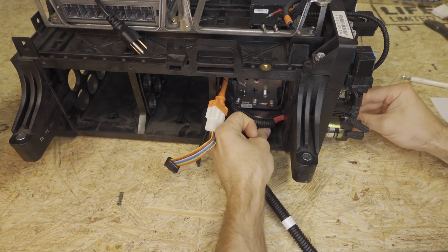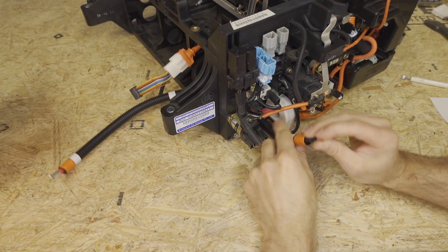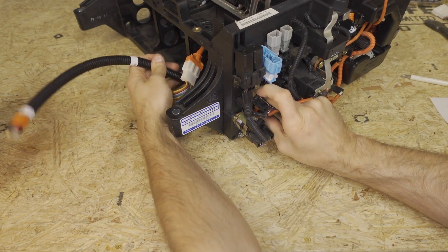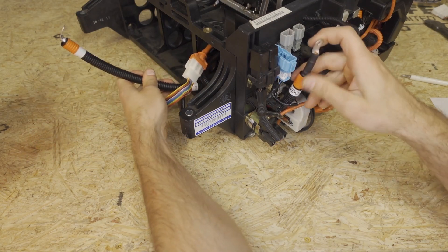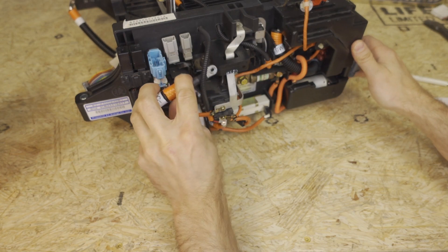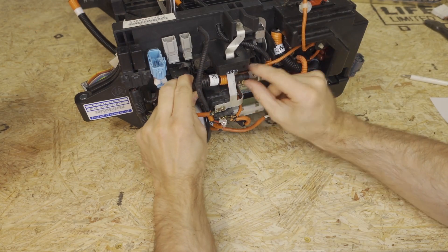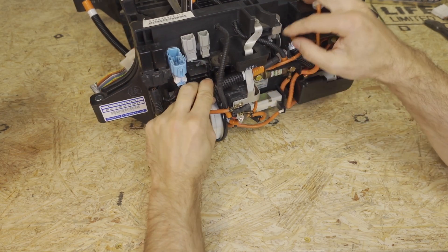Make sure when the eyelet comes out on this side that we're still underneath. Once you come through with the HVDC negative, we're going to route underneath everything — underneath the bypass connector cable, underneath this resistor, turn right and go underneath this bus bar, underneath the LIBC positive, underneath this orange cable, and underneath the LIBC negative.